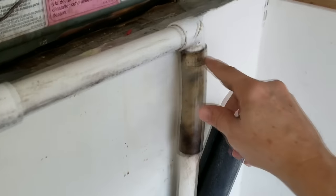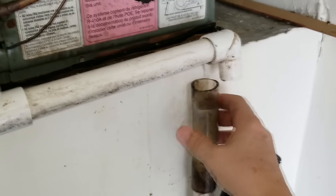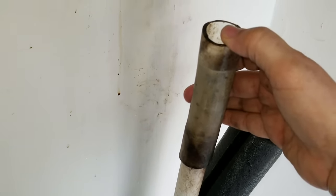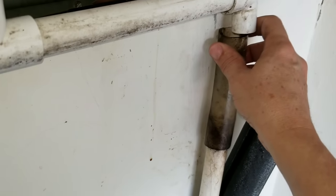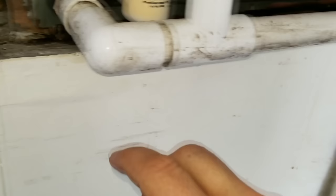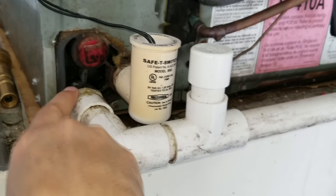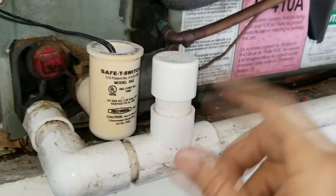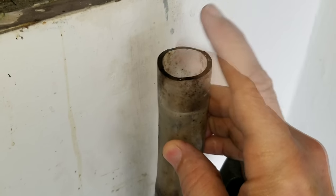So here's what we're going to do. We're going to separate this right here — earlier water gushed out, so we won't be able to show you that, but that's what happens. We're going to take a garden hose and stick it in here and gush water for about two or three seconds, which is usually enough to clear whatever is blocking the pipe. You can put the hose in here, but you need to block off the back so that when you gush the water, it doesn't rush inside the air conditioner. That's why I popped it off and I'll plug the hose right in here.